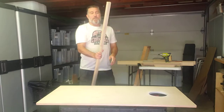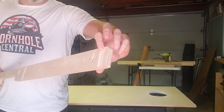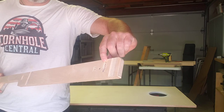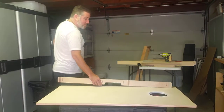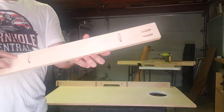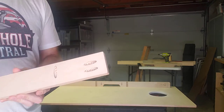So you've got two rails and these are all labeled. This is the right side and as you can see it's got grooves here for the cross pieces. It's got a hole pre-drilled for the leg bolt and it's got these pocket holes that you're going to use to screw it down to the board. You also use those pocket holes to attach the pieces, which is what we're going to do first.